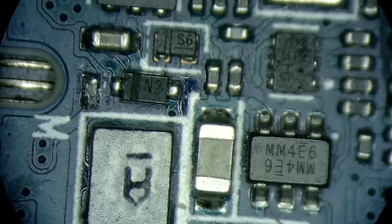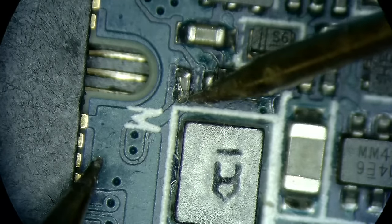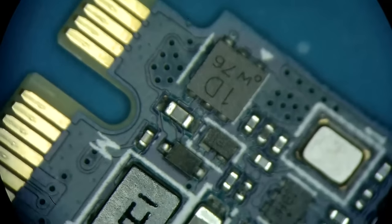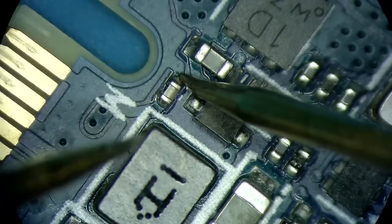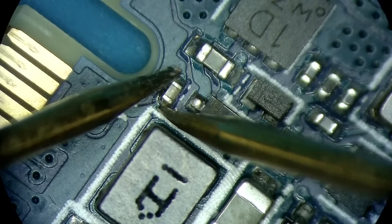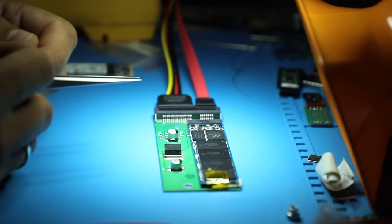And if we set it up for the test, this would mean that the circuit is closed. And it obviously is closed because it's got a wire running from one end to another. Guess what? That wire is not from the factory. Here's what the donor looks like in that same spot. This is the component. If it's closed circuit, it's gonna do this noise. And if it's not, it's going to do the single beep. Because one end of the terminal is on the ground and another one is connected somewhere else. I think somebody decided to sabotage the device.